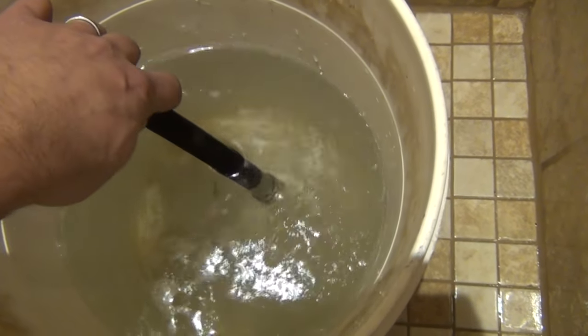The boiler's been running a little bit now. You can see our pressure is right around 20 psi — maybe a little less. That's normal when the water heats up; when it cools down it drops back to 12. Kept an eye on everything — looks like we're pretty good. No leaks. Our fittings are nice and dry. The packing nuts aren't leaking on the valves, which is good. That valve down there is holding, which was a surprise. Expansion tank looks good too — went ahead and dated it so the next person knows when it was installed.